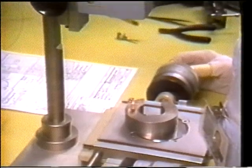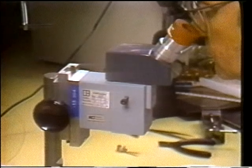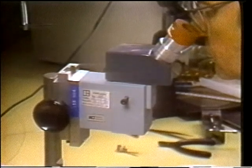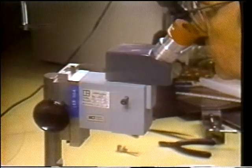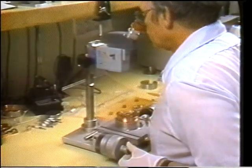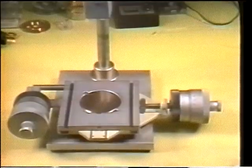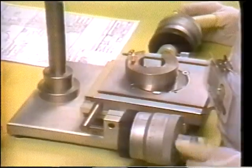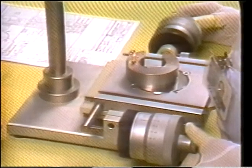Let's begin with the optical micrometer, the most commonly used optical instrument. In some ways, it functions like the mechanical and electronic micrometers we've already seen. The optical mic is used mainly during assembly work — for example, to check dimensions after welding or brazing. It is often called a traveling mic because the object to be measured is placed on a movable table slide. The table slide, connected to a larger base, moves on ball bearings and is spring-loaded to absorb backlash.